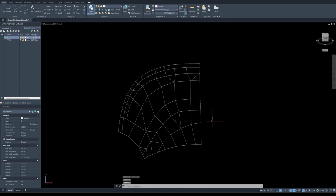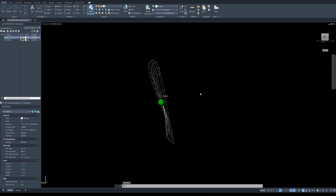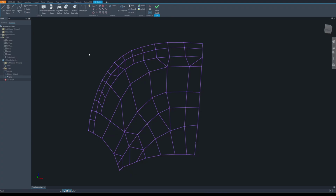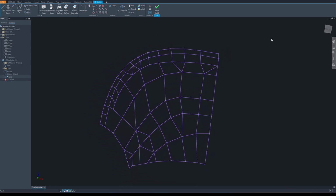which can be used to create surface and unwrap for the flat pattern. But you can't unwrap it here in AutoCAD because it doesn't have this function. So you're going to need to reconstruct the surface by using Autodesk Inventor, and then you can flatten it. Okay, this is the 3D lines that we exported from Blender, and this is in Autodesk Inventor.